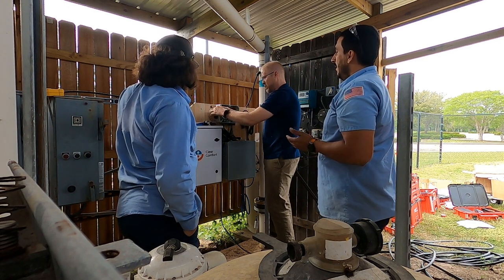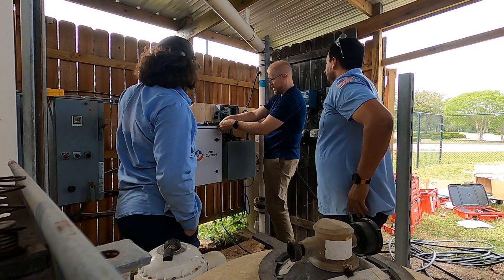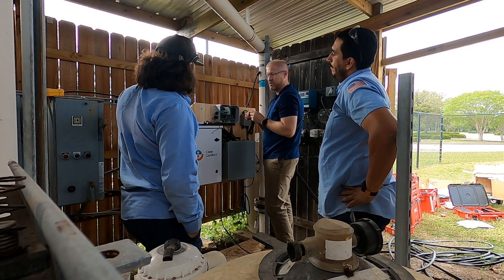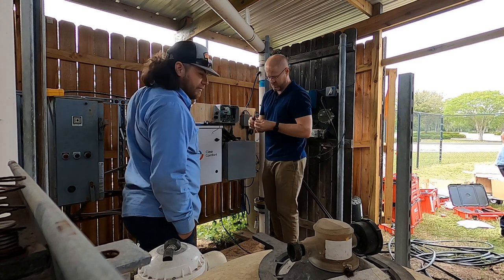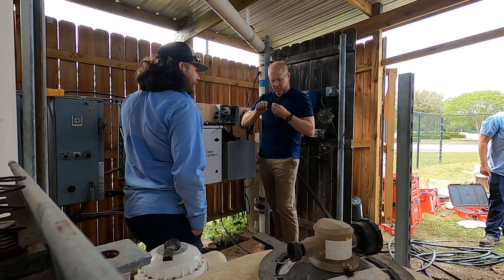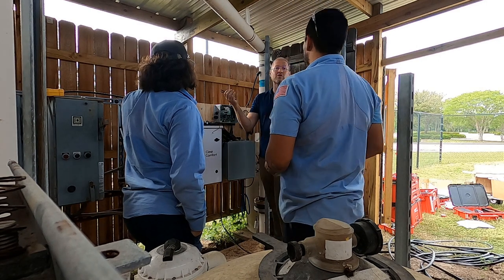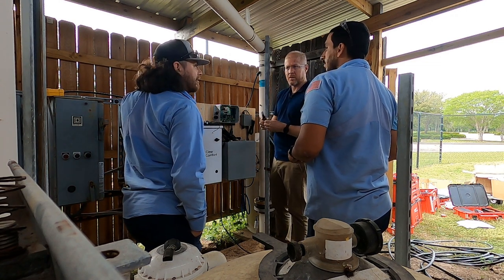So now, the next thing we're going to do, when you're setting these up, something you have to remember is that there's a dip switch in here. Yep, three of them. What do you think those control? Three dip switches. Look at the face. Whatever, the 1, 2, and 3. There are lights on there that say 1, 2, and 3, right? Yeah. So those are the inputs, the switches, the sensors, like a pressure switch, a flow switch, an integrated pressure switch, a current switch. It could be a photometer. It could be any sort of switch that can turn on and off. They're each their own, or whatever you're putting in.